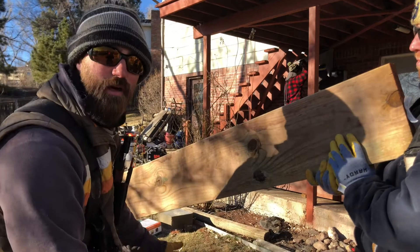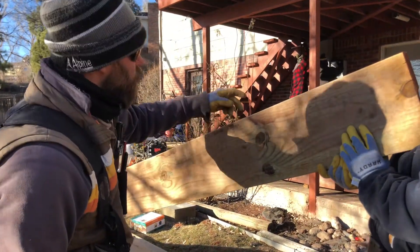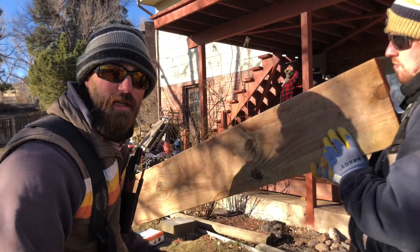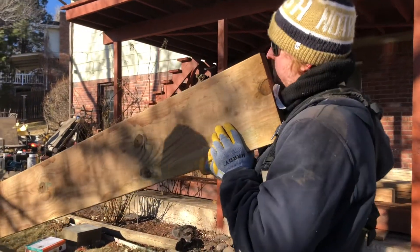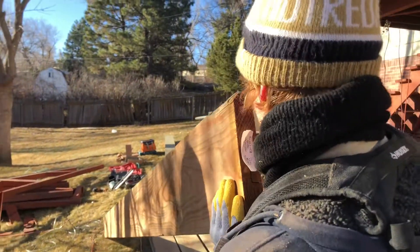We always just lay it towards the house right here. We're doing it so we know — we don't mark our boards because it's gonna be a finished product. The only time you mark it is on the top. We don't mark bottoms or sides because again, that's a finished product unless we're waterproofing. So when you're looking through it, you go ahead and get it up on your shoulder, look down and then flip it over, check the other side to see which side has the crown.